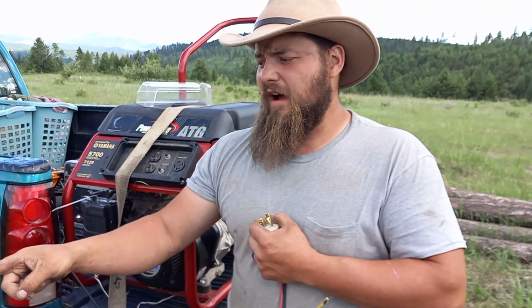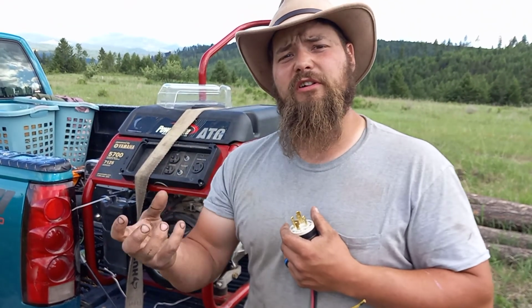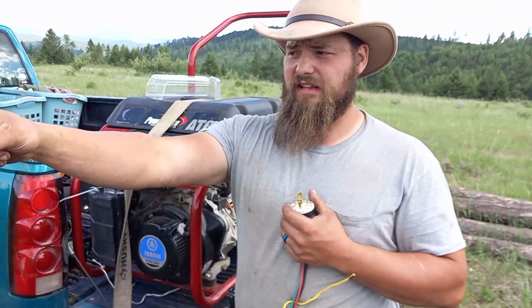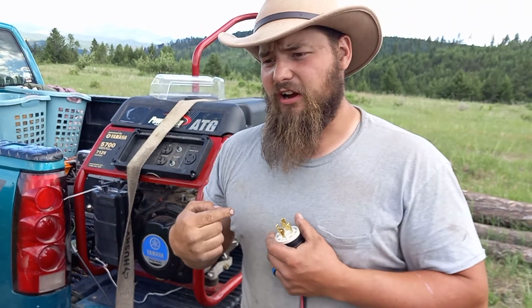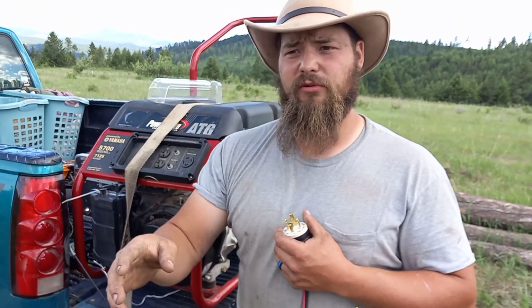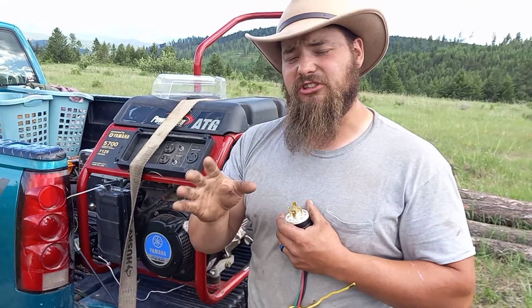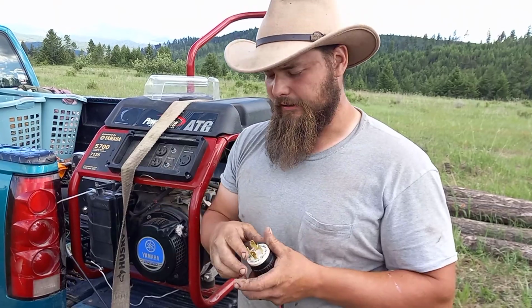technically that motor, when you fire it up, is just pumping so hard but it can't go anywhere, so it starts cavitating and then the motor doesn't cool properly and it'll burn your motor out. So what we do is we always leave the frost-free wide open so the hose can always flow. In our case, we're just filling a tank or running it through a hose to water livestock, which we actually don't do anymore. We've come up with a different system, but we still have that capability.